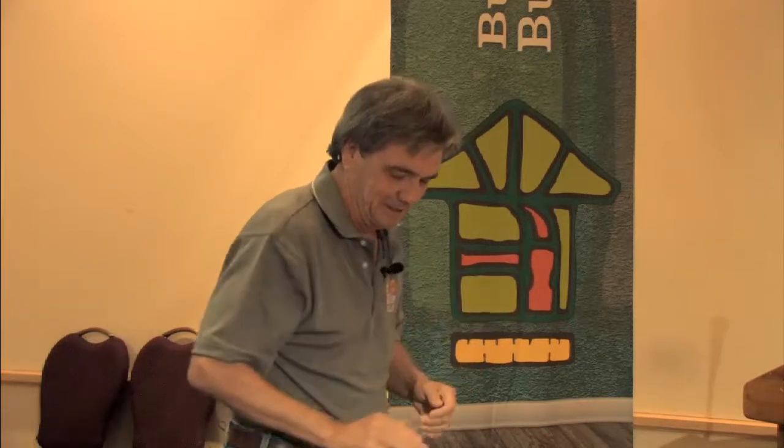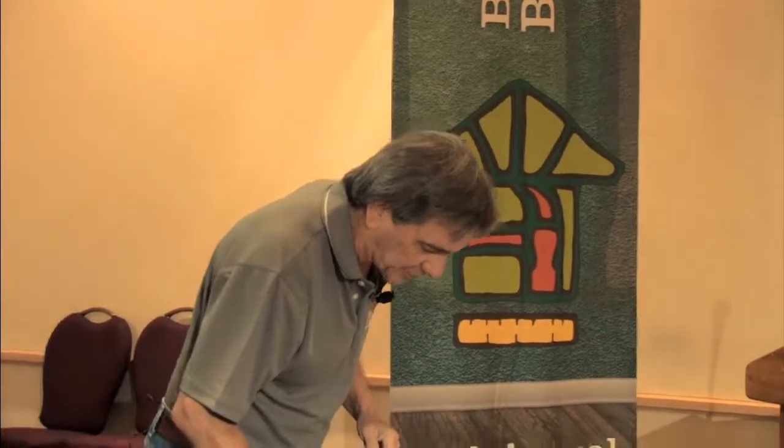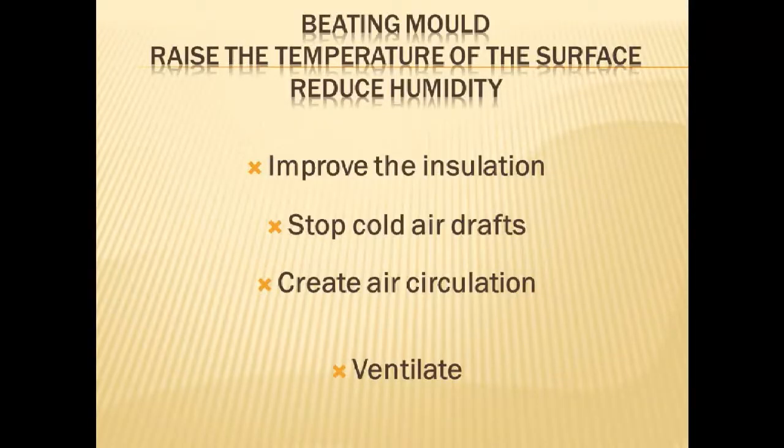If you don't want to get that fancy, you put a styrofoam strip that covers it on the inside and then a little drywall to cover that. You've got a funny notch, but it looks kind of cool. But most important, it stops the condensation because I don't have that cold, cold, cold spot collecting the moisture. Right? So the other part of that, though, if you go to the next slide, your really simplified basic principle.